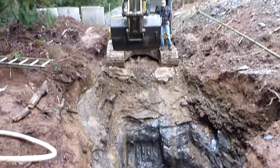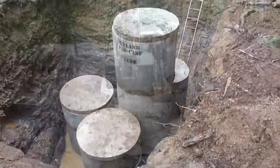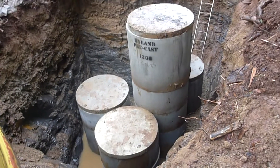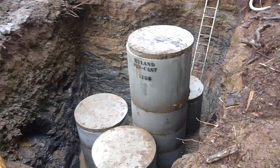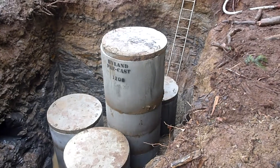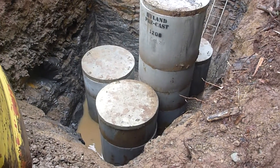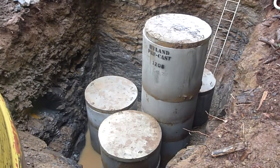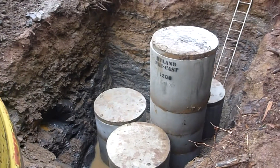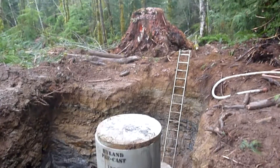We've got the hole cleaned out, so let's start throwing some material in. We've got some rings — towers — installed. We've got a fair bit of capacity there. Now we're going to fill up all around with drain rock and oversized rock, which will give a bunch of annular space and a little more water holding capacity. After we get that filled up to basically the layer where the water's all coming in, we'll cap it off with some concrete to seal it off from groundwater, and backfill up to the surface.